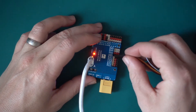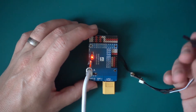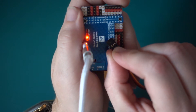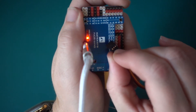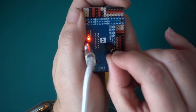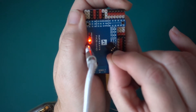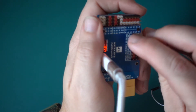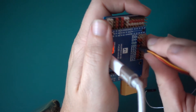The F405 deals with that quite nicely by setting up the smart serial straight away. So I've wired up this plug. On here we have ground, 4.5 volt, and SBS which is S.Bus. S.Bus here is actually the same UART receiver pad as R2 — it just has a hardware inverter between itself and R2 before it goes to the processor. FrSky has everything inverted, and I believe it's Futaba's fault because they've taken everything from Futaba.